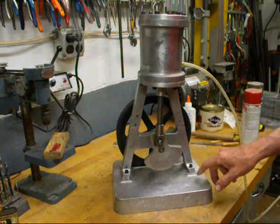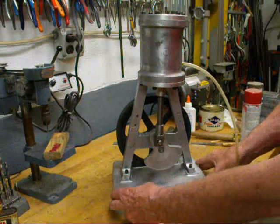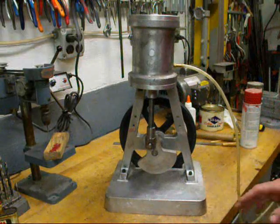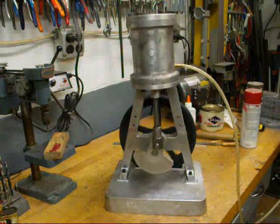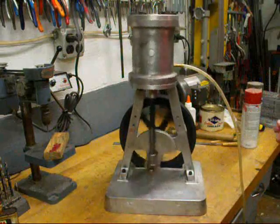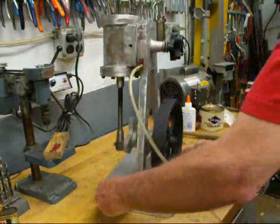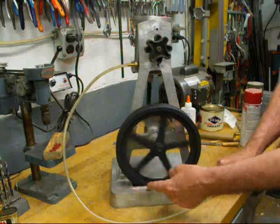We've got the frame finally bolted on to the base — there wasn't much to show you on that. Just transfer the holes with transfer punches, got her bolted down, reassembled, and ready to run again. And then we've got to paint it — that's really our last step. Got all the bolts on the bottom; there were only two on there before, now we've got six bolts on the top and on the bottom. See how nicely the flywheel fits into that slot.